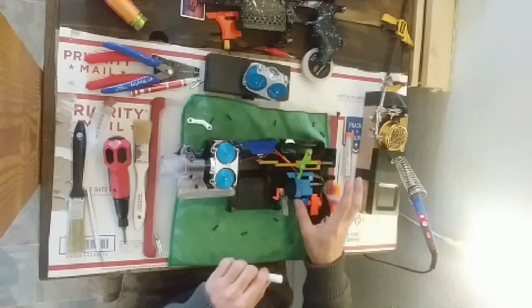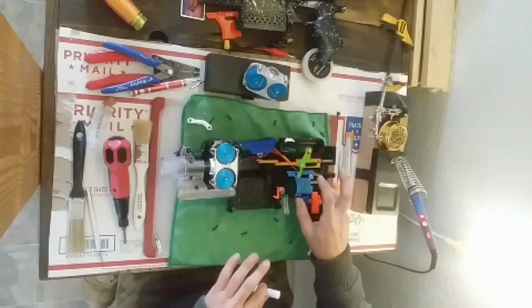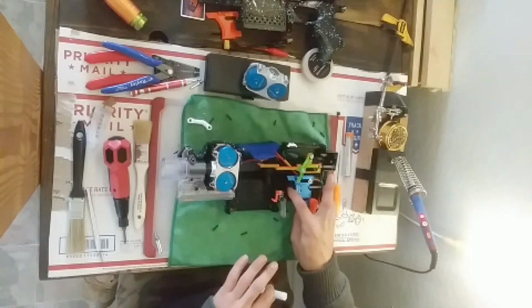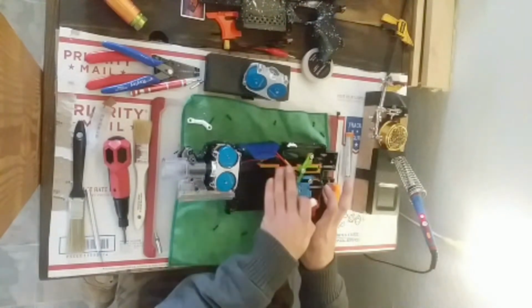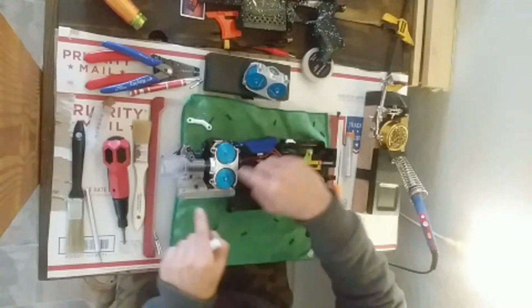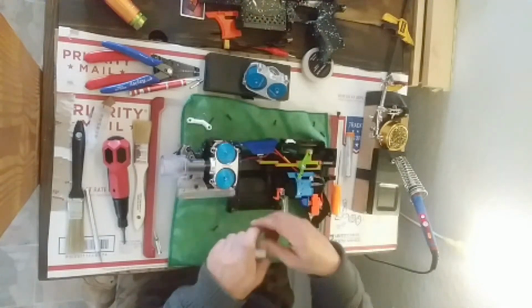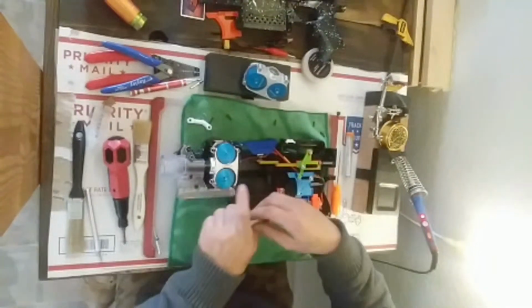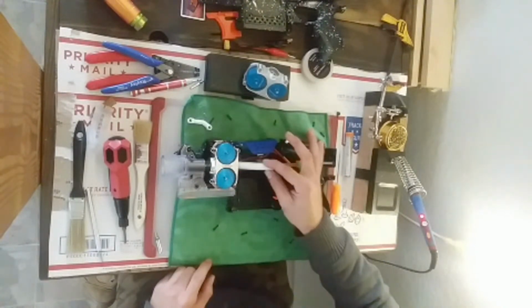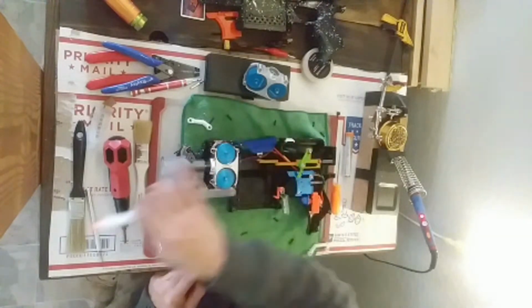As you hit the rev trigger, which is this one down below, it charges all the electronics and gets these flywheels spinning, one clockwise, one counterclockwise. And while they're both spinning, the dart comes through and gets squeezed by the flywheels and gets zapped through the barrel.